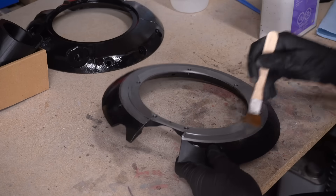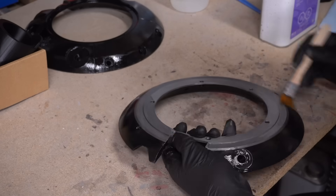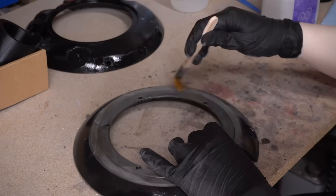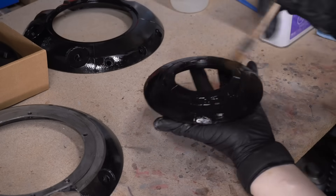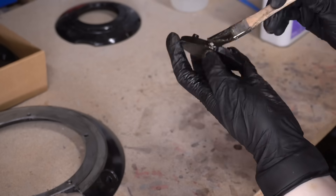Like for instance, a lot of these parts have more of a curved surface, so the top surfaces and the tops of the domes need a lot more work than the sides of these parts do. That is why you see me scrubbing over the same areas with a brush, because that is how you end up smoothing it out. Just applying the liquid will start to melt everything together, but rubbing over the areas using the brush is what really makes all of those lines disappear.